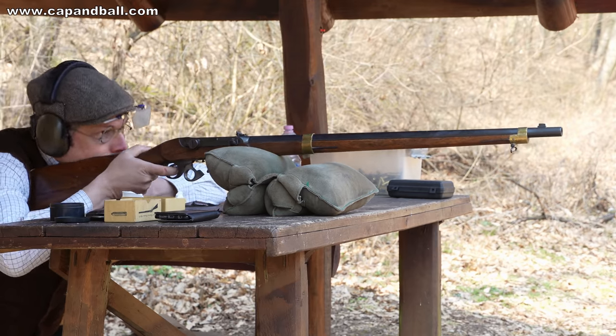Well, my cartridge is not the exact copy of the original, but I happen to have a bullet mold that completely fits my rifle. It is not the original shape bullet, not the Swedish bullet, but it's a contemporary design. It's a Spitzkugel bullet. Well, I slugged my bore to measure exactly the diameter between the grooves and between the lands. Well, the exact diameter of my bore is 14.76 millimeters between the lands and 15.40 between the grooves.